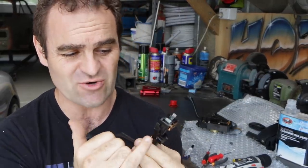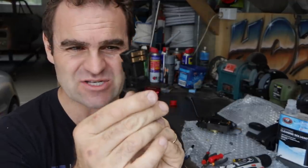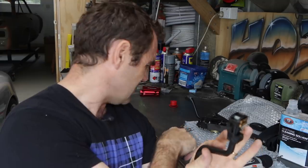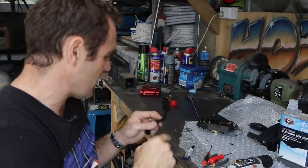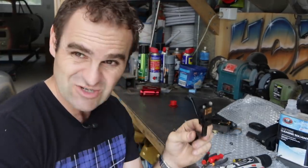All I actually did was I just cleaned up the surfaces on either side where it was joined and used a bit of super glue. For some reason these things look like they're made with a gap around the side, as if they were supposed to be spring-loaded. The trouble is that the spring on this holds them tight anyway, so they don't have any room to move. I've just glued them fixed to the sides of the unit. What I might do to get a little bit more reinforcement is find a little area of this unit where I can trim off some bits of the exact same plastic and feed them into the holes to bulk it up and give it more reinforcing. When I'm trying to repair plastic I just look for a moulding piece and carve a little bit off - there's your plastic that's exactly the same.